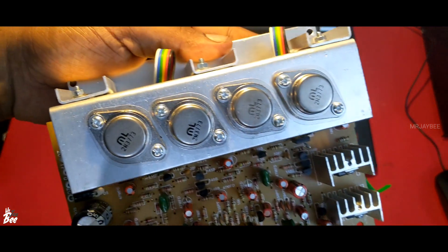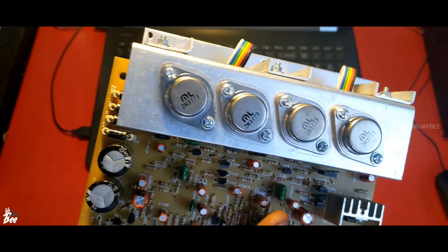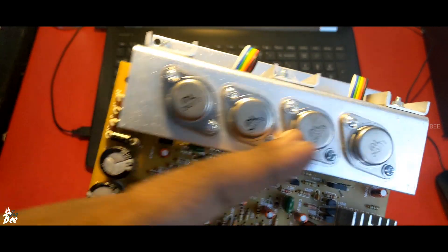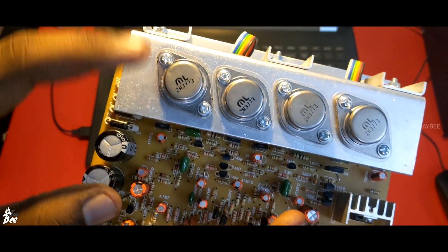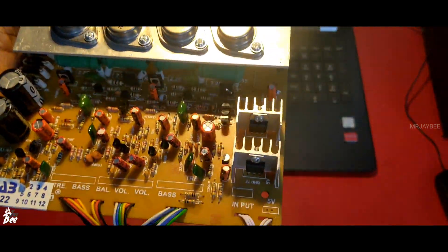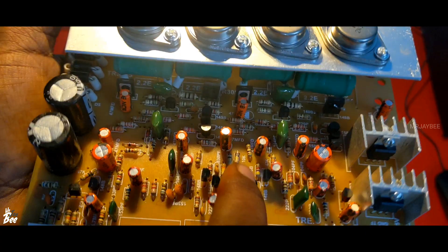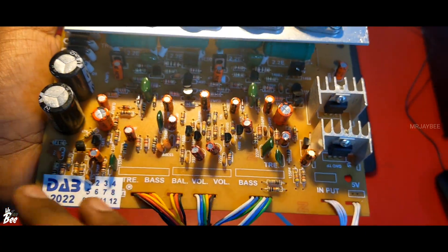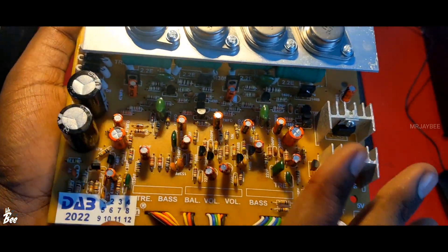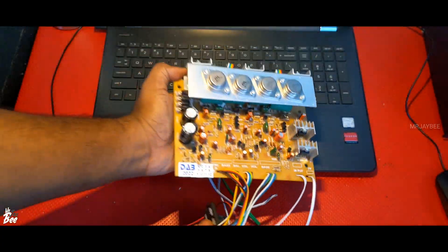I am not sure about the quality of this ML-branded transistor and how the audio output is. If you are concerned about audio quality, just replace this transistor with a Bell or a well-known branded 2N3773 transistor — you will get better output. The BT section is all based on transistors, not on an LM324 IC — it is completely transistor-based. So this was just an unboxing, and the working video will be uploaded soon.